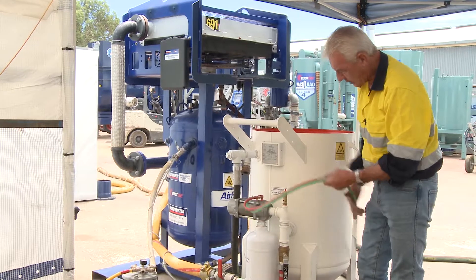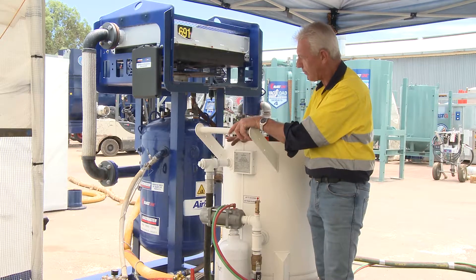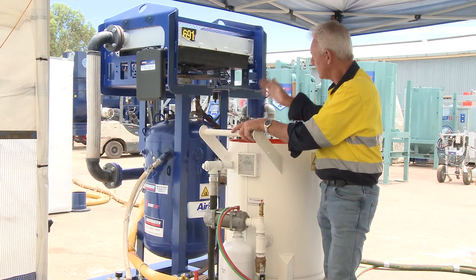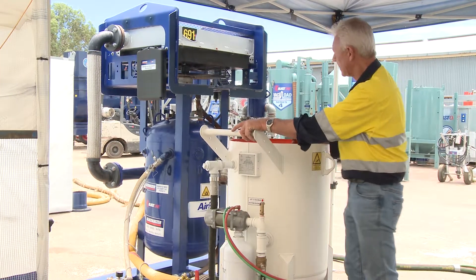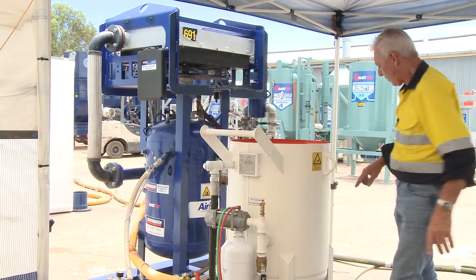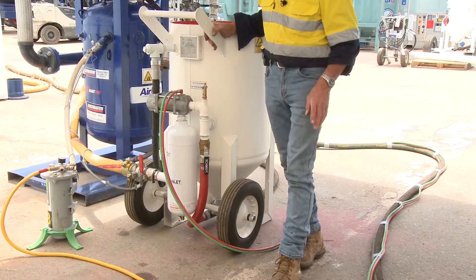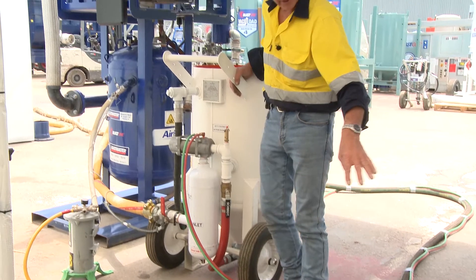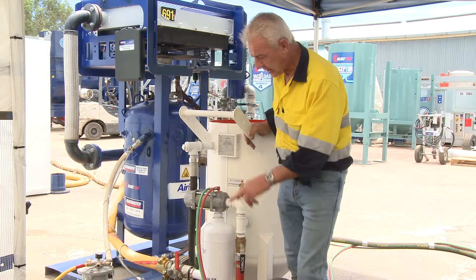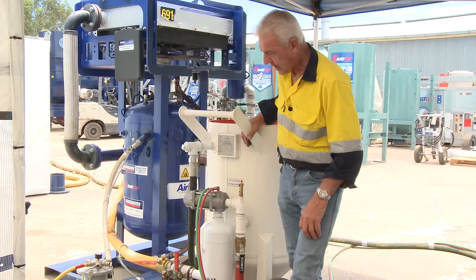The one thing to remember when you've set all this up: has the compressor had its pre-checks? Is it in the appropriate place? Is the bull hose arranged in long radiuses? Has the air prep had its pre-checks done, such as oil and so forth? Are the valves that we don't wish to utilise closed? Is the abrasive blast hose set with long radiuses instead of sharp bends? Ensure that your breathing airline is not in a place where it impedes traffic — same with your blast hose — and arrange your breathing air hose so it's divorced from all other traffic so that no one can trip on it or have it run over.